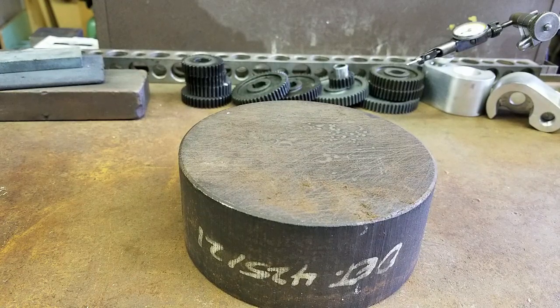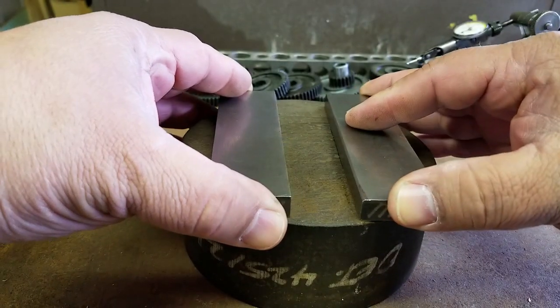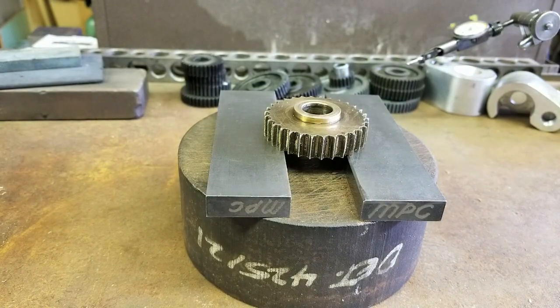We've got some measurements to continue taking so I can get a replacement gear, or hopefully find a replacement gear online, so I don't have to manufacture the whole gear from a blank. I don't have a dividing head, I do have a rotary table, and I don't have a set of gear cutters. So if I can find something close, I think that would save some money — and this is a solution that anybody who lacks the more specialized equipment, or is just an amateur machinist, would have available to them.